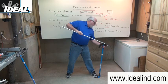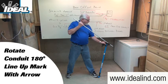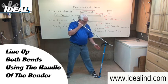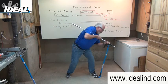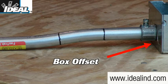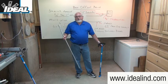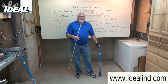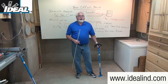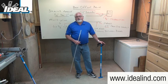Step three is to slide the conduit down to the second mark, line it up with the arrow on the bender head, then rotate the conduit 180 degrees. Line up the two bends using the handle on the bender and using constant pressure bend that to 10 degrees again. This creates the box offset in the conduit that allows it to easily slide into the conduit fitting on the side of the box. Electricians don't bend the conduit and then cut it — once they know how to use a bender correctly, the conduit is the correct length for that particular job. Good quality hand conduit benders from Ideal provide accurate and professional-looking bends.